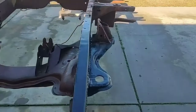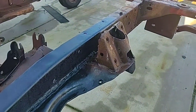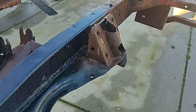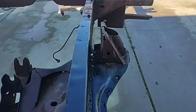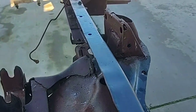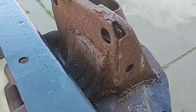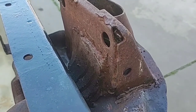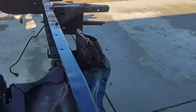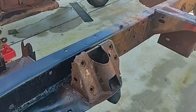These are the towers of those front ends that would always be accused of leaning in and throwing the alignment off. The pursuit vehicles — cop cars — were probably the first ones to really notice it. See that extra piece of steel right there? In the early '80s they started throwing that patch piece in to give it more rigid performance so the tower wouldn't lean in.